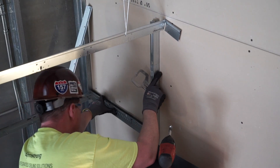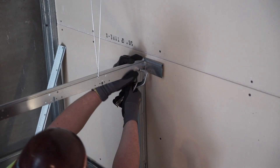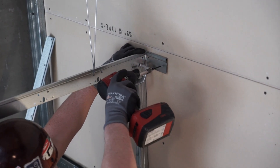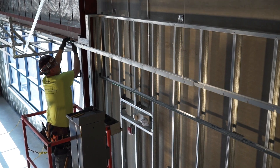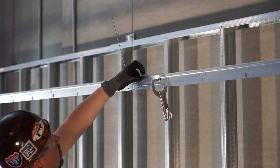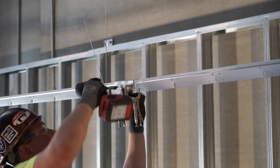We will start with the first Quick Stick tee installed against our starter wall, then secured to our Strongback. Notice how we dog-legged our Strongback with enough length to secure to a wall stud. When splicing 12-foot lengths of Strongback together down the running distance of your suspended soffit, just splice together with a scrap piece of angle and two screws on either side of the splice.